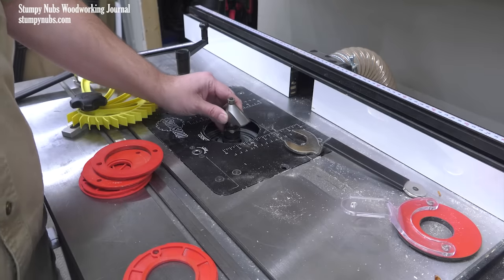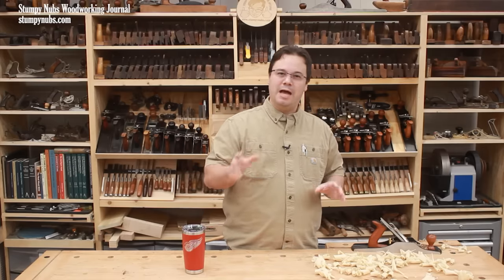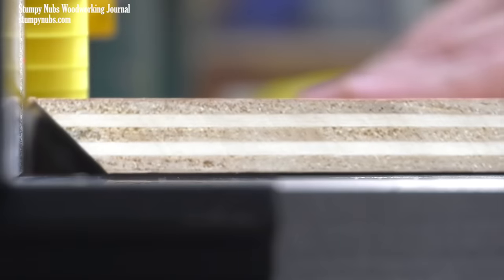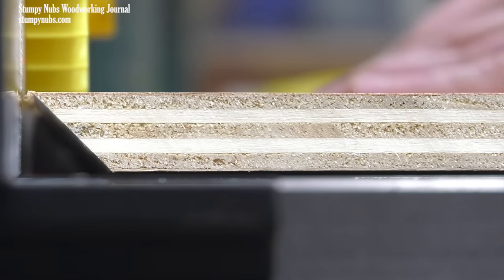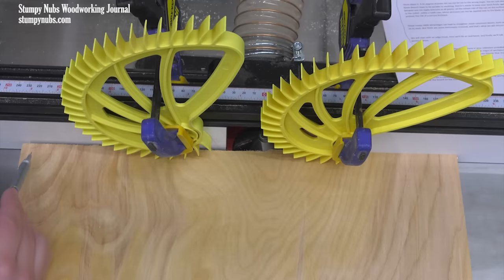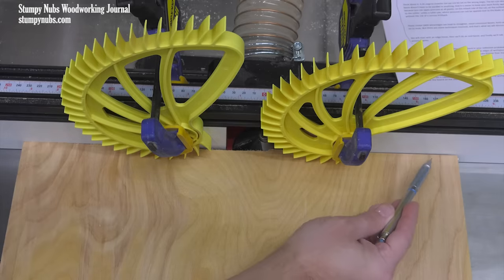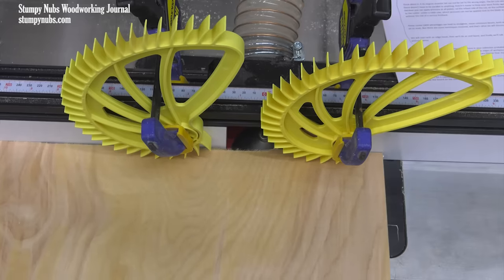Now since this bit is capable of removing the entire edge from my workpiece, I have to consider how the fence will guide the board on the exit side of the cut. If the bit removes too much of the edge, a gap will appear between the fence and what remains of the board. At the beginning of the cut this won't matter much, because the uncut portion of the board is still running on the infeed side of the fence and will support the workpiece. But eventually you're going to reach a tipping point where a shift will occur to close the gap on the outfeed side and open a gap on the infeed side.